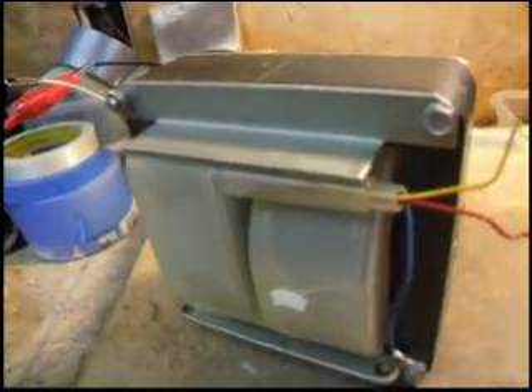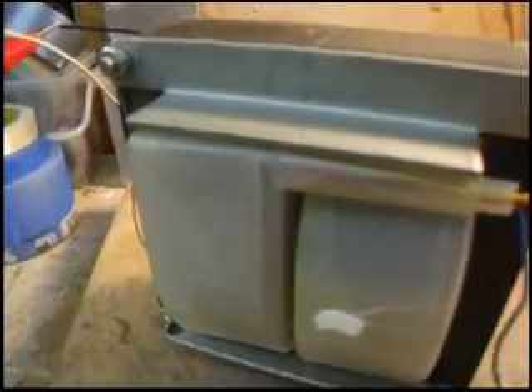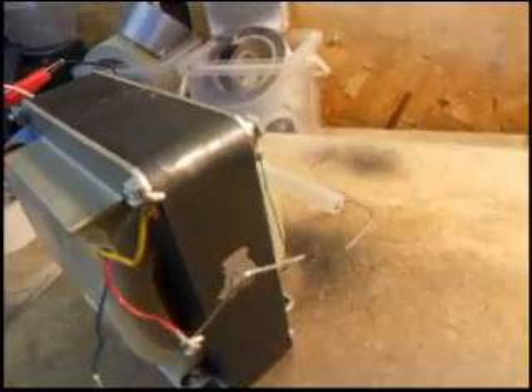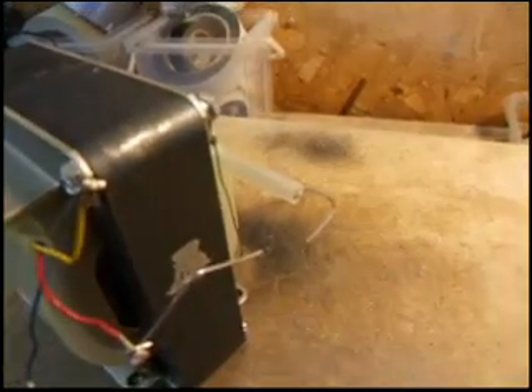There's an internal resistor to bias the tube, which will range anywhere from about 10k to about 30k. The other side normally connects to the anode of the tube.